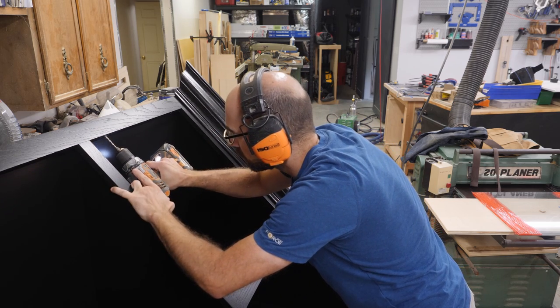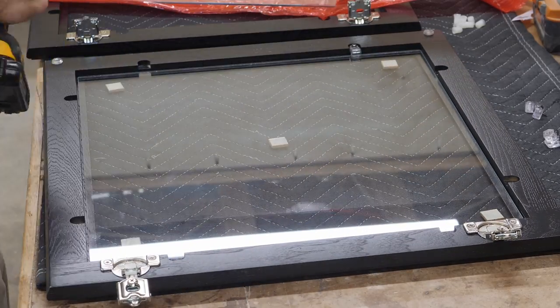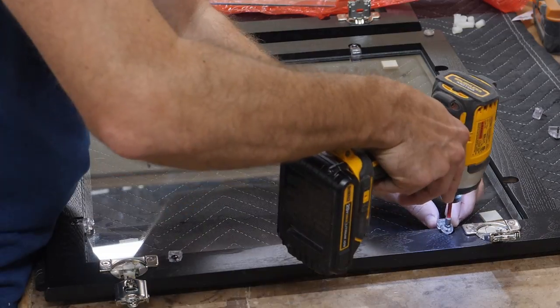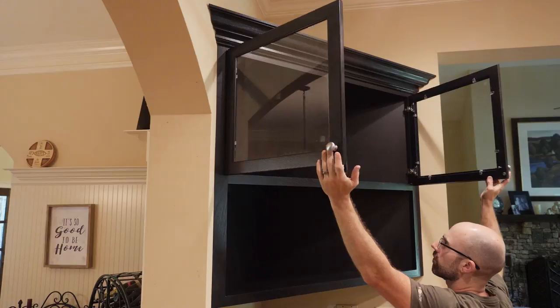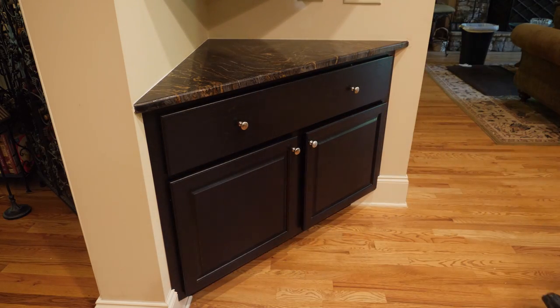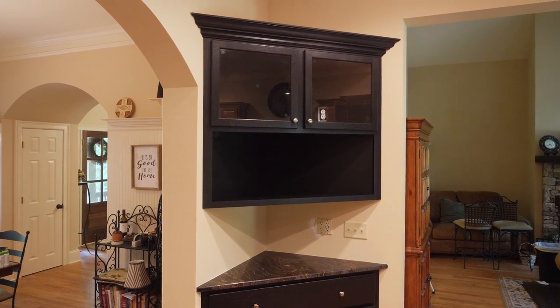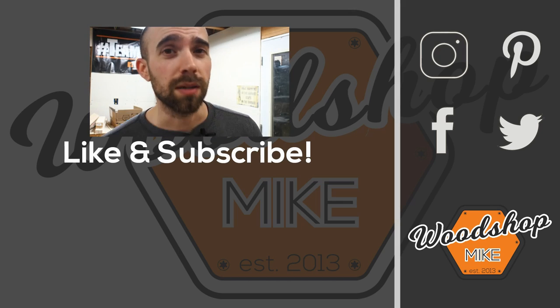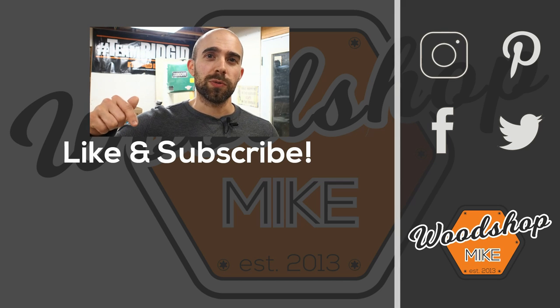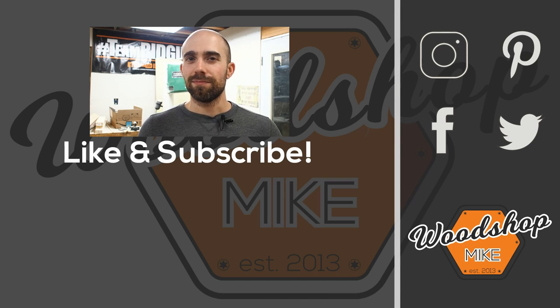You may have noticed that the cabinet is sideways — this is actually the easiest way for me to move this big corner cabinet around in the shop. Once everything is painted I grab the hinges and secure them to the doors, then line up the doors on the cabinet and pre-drill the holes that will make installing them easier later on. The last thing before install is to add the glass panels, and just to play it safe I pre-drill all the holes before running in the screws for the glass clamps. With the cabinets installed it's time to take a step back and check out the results — man you gotta love soft close hardware! Don't forget about those free plans linked in the description below. If you enjoyed this video please hit like and subscribe, and until next time have fun making something.